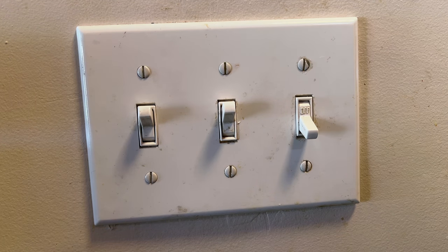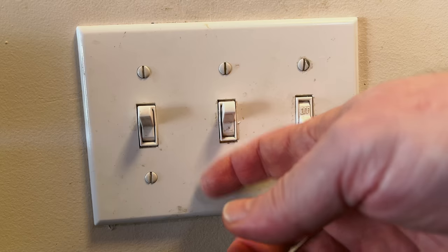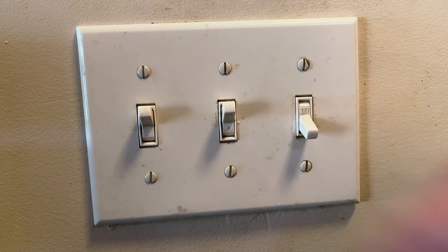So you want to look at the terminals for the traveler, look at any wire nuts that are pigtailing down to the traveler, or more likely the switch is just old because we use it all the time and needs to be replaced. Every time the contacts open and close they arc, and eventually it just falls apart. I'm guessing that's what's happened here.